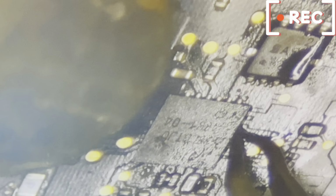Yeah, on 2015, the backlight driver's chip is easier to fix than the one on MacBook Pro from 2010, 2011, 2012, all those ones. Their backlight driver's chip is too difficult. This one, you can close your eyes and fix it, if only you know how to arrange your rig. It's something that you can do. I believe you can do it. The only thing you need is just the tools. What do you need? The microscope, your heat, your workstation, that's a heater, your lead, your picker, your tools for screws.